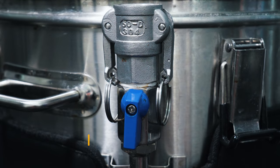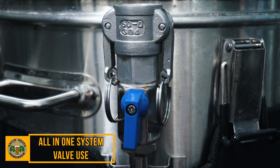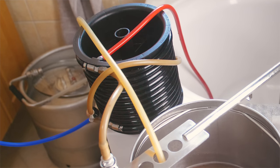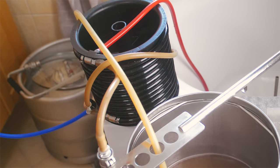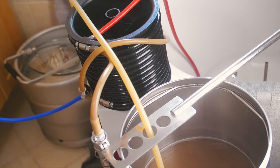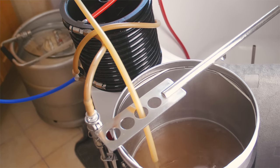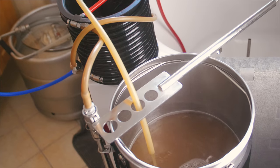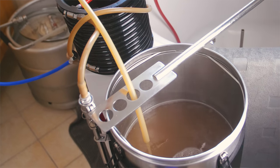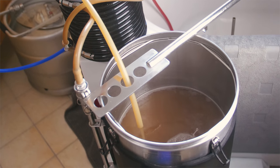Very commonly found on all-in-one brewing systems is this valve that is placed at the top of the side pipe that is connected to the system's pump. The reason for this valve and the purpose of its inclusion in the all-in-one brewing system's design is so that the flow can be controlled when cooling with a counterflow chiller like the one supplied with the Grainfather. By slowing down the flow during cooling you can cool the wort within the counterflow chiller much more effectively. This is especially useful when using water that is not as cold as would be ideal, as found in countries with higher temperature groundwater like in certain parts of Australia, for example.